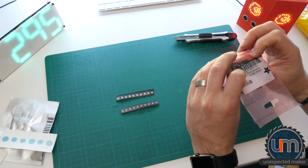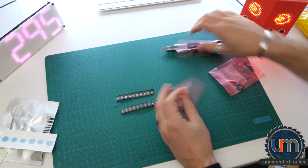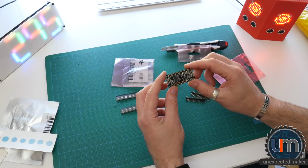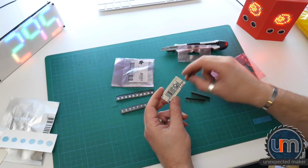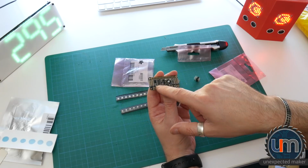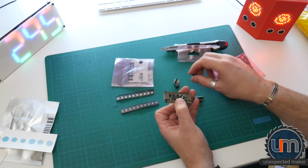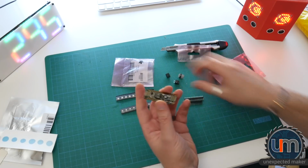What's that? Oh, that's my servo FeatherWing. Oh, I forgot I ordered that. So this is a FeatherWing for the Adafruit Feather M0. Well, I've got a few different M0 types. There's obviously lots of different feathers. And this is actually a servo wing. So it lets you connect lots of different servos. And it's got a servo controller on here. And so it sits either on top of a feather, or you can just wire up however you want. But it's feather compatible layout. And I have some projects coming up where I want to control a bunch of servos. So that's what that's for.